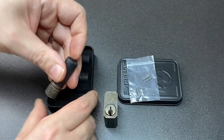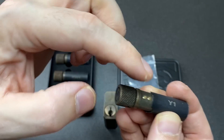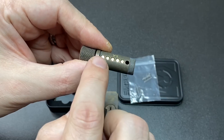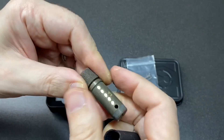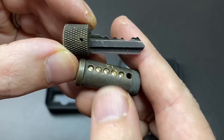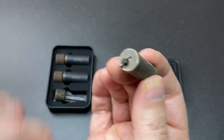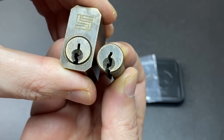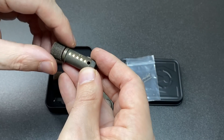So what you can do is swap these out. It takes a little bit of effort and you need to align the top of the key with the way you pull it out so you don't end up dropping the pins. If you pull that out you'll see it's already pinned to the key. I can't remove it because the pins are in the way — gently remove that. You'll see you have a key and all the pins. But look, the keyway is different. We've got a different star keyway — that's the Y1 — which will require a little bit more skill to navigate.